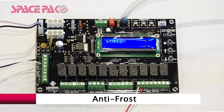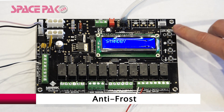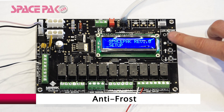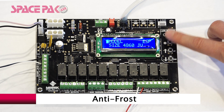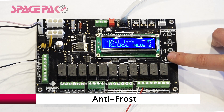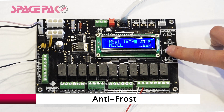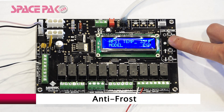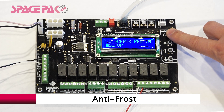The anti-frost protection temperature setting allows you to adjust from 34 degrees to 50 degrees Fahrenheit — this is the temperature of the primary coil. If the coil drops below the set point, the anti-freeze alarm will be signaled on the screen. To access, hold Escape for three seconds, Select on Setup, then Select on Unit Settings. Scroll to the AFST menu, hit Select to access, go up or down to set your set point, then hit Select to save and Escape out to standby.